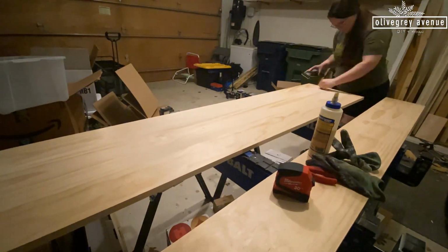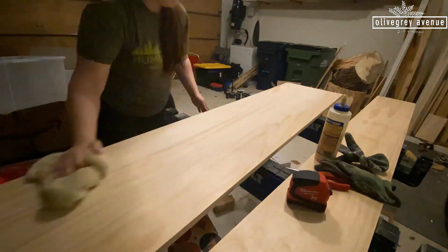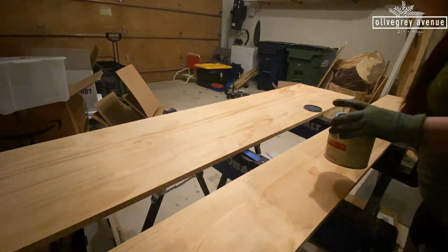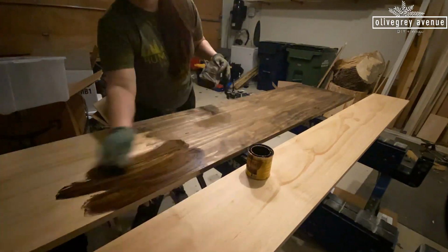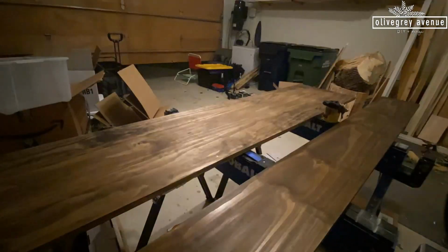Once the boards were all dry from the glue up, I sanded everything down to be smooth and even. Then I applied a layer of wood conditioner to avoid any splotchiness with the stain, and then I stained it with the color Jacobean. All the supplies I used for this project are going to be linked down in the description.